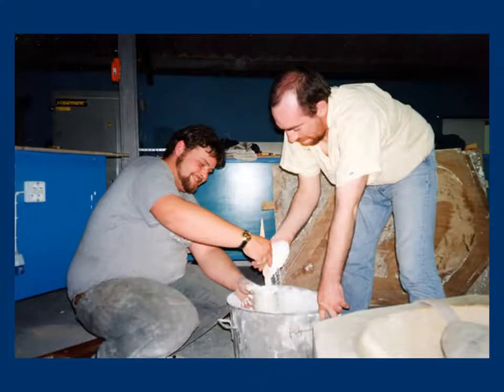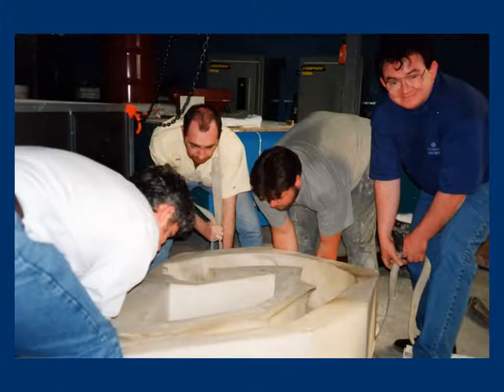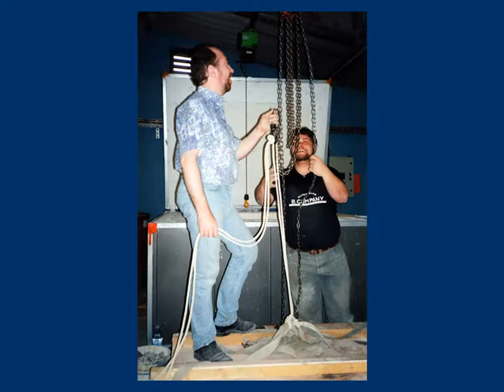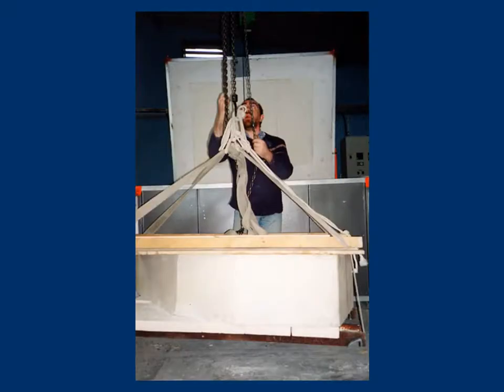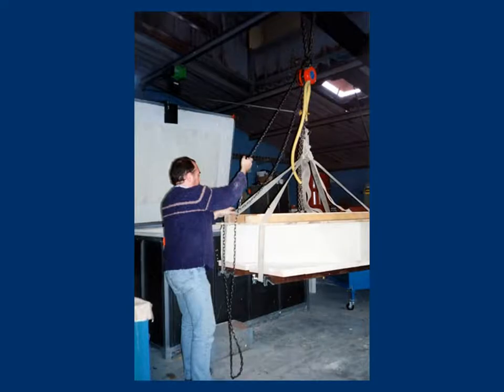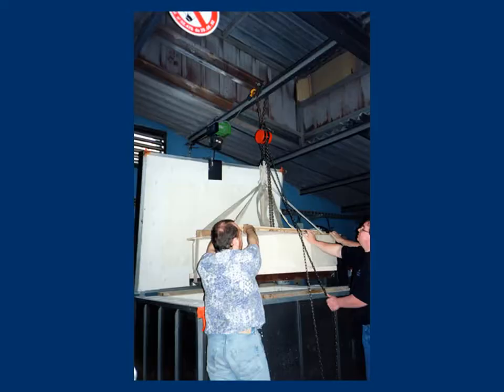This is further reinforced by the fact that there is no resistance on the ground. The two U-shaped metal bars serve different functions: first, to lift up the mold so as to favor air movement below the piece; then, to support the piece while introducing it into the kiln. Fireproof sheets set in between the U-shaped metal bars and the mold serve different purposes — a physical function to distribute forces, a thermal function to stabilize shifts in temperature, and to ensure the size variations of the different elements.